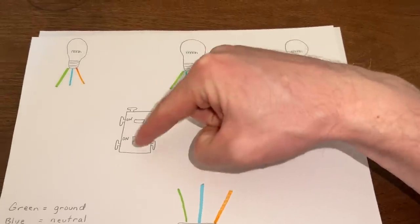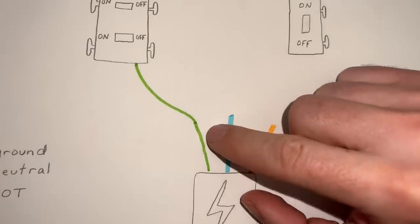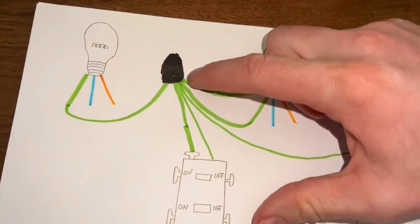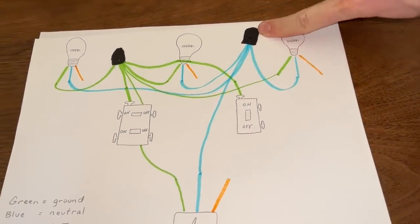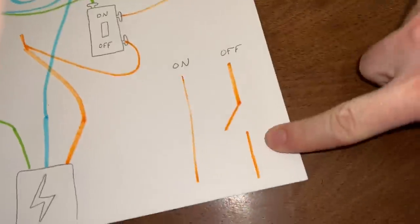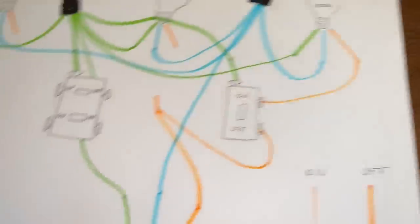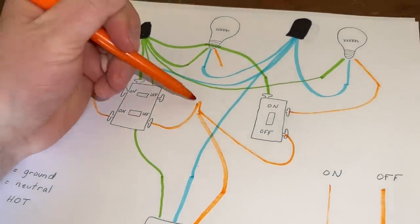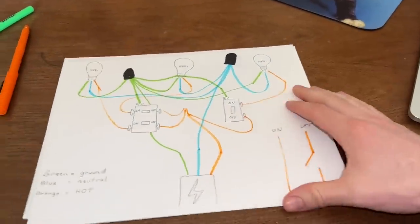Each of these individual light bulbs — when we turn on this switch we want to be able to turn on that light, when we turn that switch we want to turn that light, when we turn that bottom switch we want to turn that light. The ground wire is the one that doesn't have any coating on it, it's just a gold wire. We're going to run all the grounds and put them into a wire nut, then electrical tape that together. The blues, the neutrals, are pretty easy — they all go into one wire nut. The hots are where stuff gets interesting. The power comes into the switch and when it's off it's not letting the hot current go through, but when you turn the switch on it lets the juice through and boom, we have a light that's on. We just connect the others up just like so, and that is why it looks so confusing inside of an electrical panel.